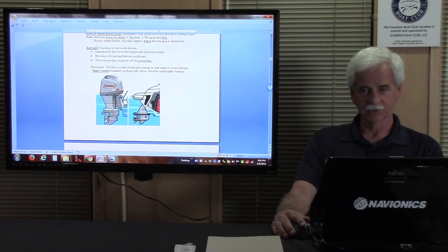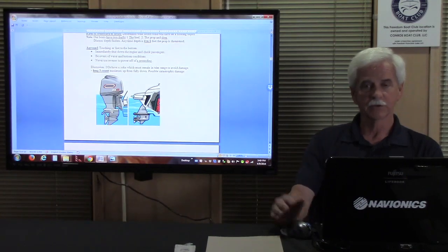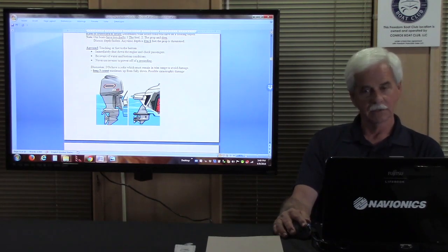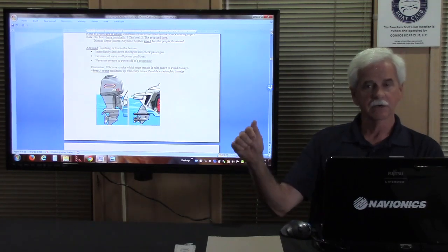So, we have some critical training items that we'll cover again, but for all of the outdrives, inboard, outboard, and a straight outboard, all motors will be fully down before you start. Always run them all the way down before engine starts. The motors will be in the operating range only for all operations. And for an outboard, right on up as high as you want to, just as long as you're producing water. But for an inboard outboard, from fully down trim, our maximum trim ever is going to be 1001, 1002, 1003, a long 3 count. That's it.